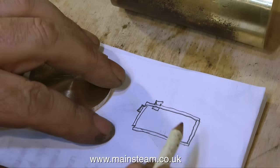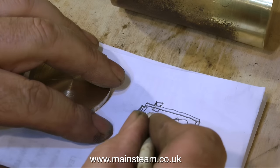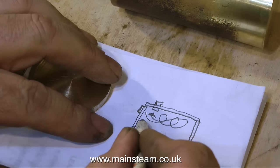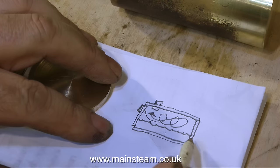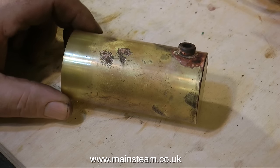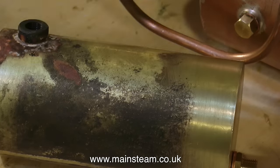On my sketch you can see how it works: the exhaust comes in here, and this is the steam inside the condenser — it starts to condense a little bit, but not too much; most of it goes up the chimney and out into the atmosphere. The purpose of a condenser oil trap is to keep the oil inside the condenser, because the oil does not go up the chimney. The surplus oil ends up floating on top of the water in the condenser. After a while the condenser will fill up with water and will need frequent emptying, generally at the time when the boiler is ready for refilling with the hand pump.